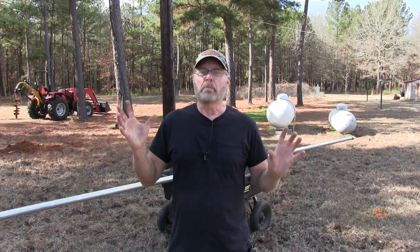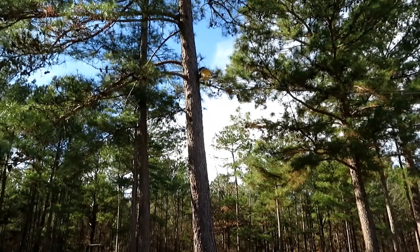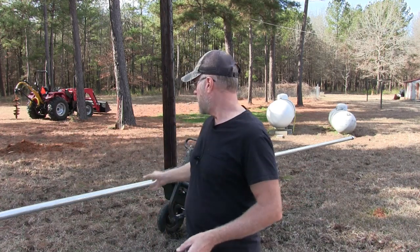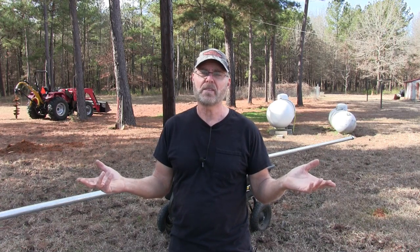The ones I'm replacing were 175 watts, the mercury lights. And like I said, the light was kind of green, and I didn't like them. And they made that buzzing sound when they're on all night. Anyways, those are 175 watts. I'm replacing the one on my shed there, and this one up here in the tree, that one's also a 175 watt mercury light. So 175, 175, 350. I'm replacing them with two 75 watters. That's 150 for both. So that's a savings of 200 watts right there.